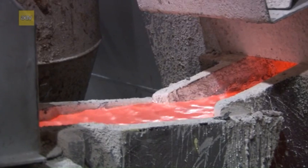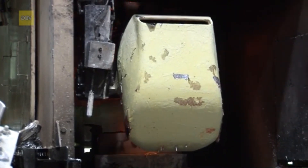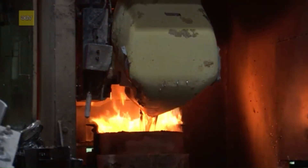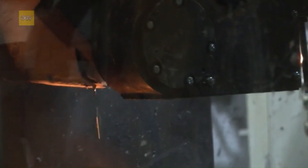The prepared model is ready for the real action: casting. Finally, molten aluminum, heated to 780 degrees Celsius, is poured into the mold. The EPS vaporizes instantly, leaving a hollow cavity that the metal fills perfectly, capturing every intricate detail of the design. The aluminum alloy used in this process typically contains 6% silicon and 4% copper, making it strong yet lightweight.